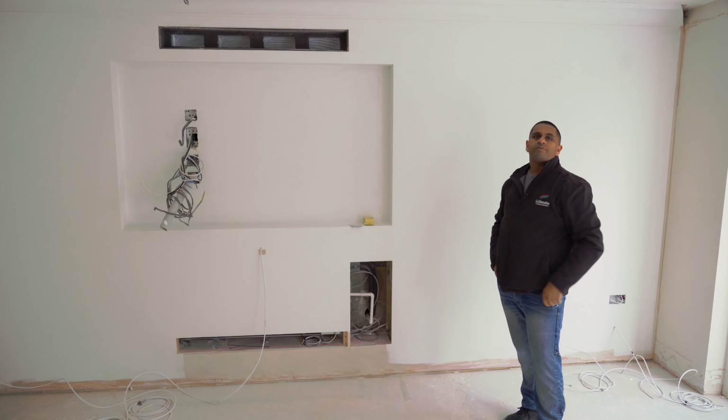So follow me out to the garden, guys, and we'll show you our services being installed at high level from the back bedroom floor mounted unit. What you're looking at are our refrigeration pipework, and the white pipe is our condensate drain. If you want to follow me over to the side alley,